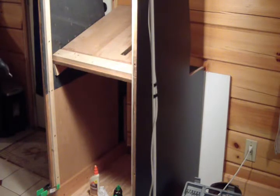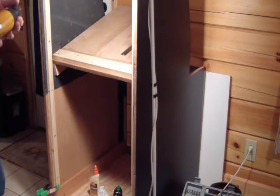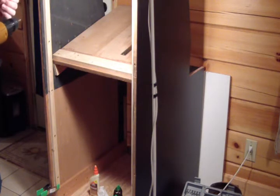Feel on the other side where the laminate is, just to make sure those screws aren't pushing out on the laminate, and they shouldn't be. I should have at least an eighth of an inch before it even breaks the surface on the other side. But if you drill with those paddle bits a little too deep, it will let those sheetrock screws recess so deep that they may poke out the other side, so you've got to be careful about that.